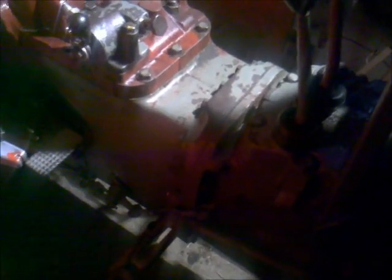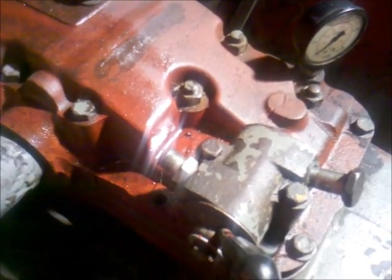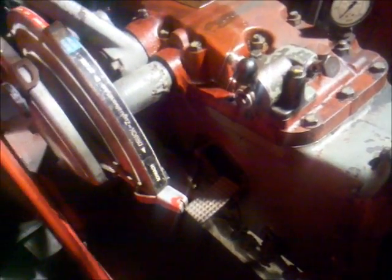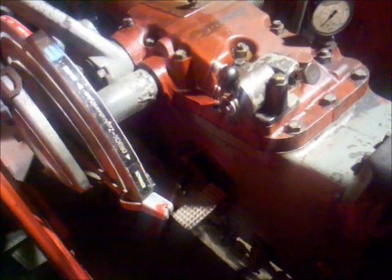This was mainly the big part of the work. I now have to readjust the draft control for the absolute maximum pressure and adjust it to 170 bar, like it's supposed to be. Then I will put all the stuff — brake pads, brake linkage, and the seat — all back together, and I guess the work is done.